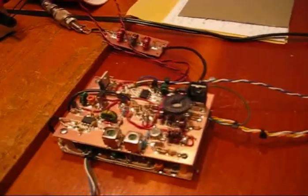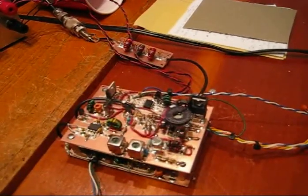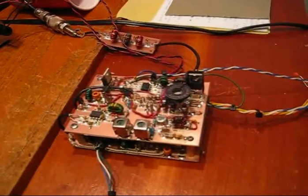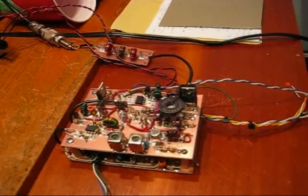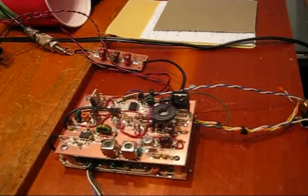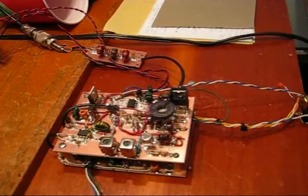You're listening to a sample of my homebrew 40 meter QRP CW transceiver that employs four MMIC devices. This is N6QW and what you're seeing here is the two-decker. On the lower deck is the receiver and on the upper deck is the transmitter. This transceiver will produce six watts, has an IRF510 in the output, and the four MMIC devices are TriQuint AG303-86Gs.